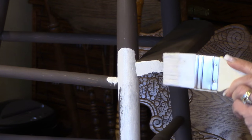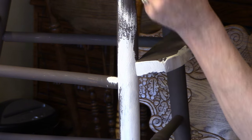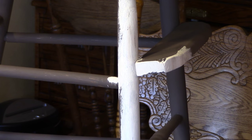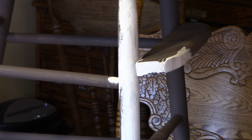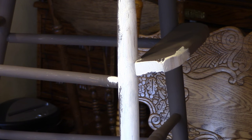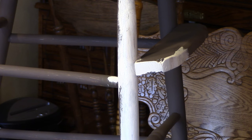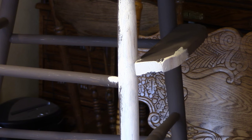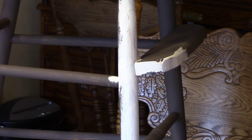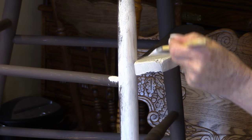Chalk paint has a very flat, non-reflective chalky surface on its own until you wax it. You can literally do a piece in an afternoon and get it all completed and ready to cure. The curing process is the wax having to cure — it doesn't necessarily have to harden, but it has to latch onto the surface and everything underneath to really set and dry. So if you were doing this to resell, I would not let a piece go until it had been completed for three days and was really well cured.